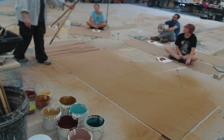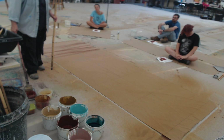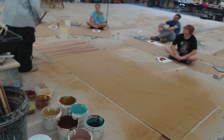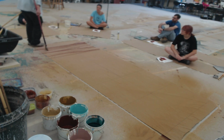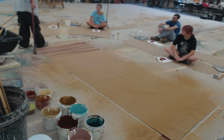Look at this brush. Look at this poor, tortured soul. Right? So we can do combing techniques using just regular brushes. But honestly, it's the scrappier brushes like these that do the better combing technique, okay? But sometimes we want a more coarse combing technique. And then that's when we take chip brushes, only chip brushes, and we torture them into these shapes. But if you want finer combing, you can just use kind of a rasty brush like this, and you can get finer combing just by letting it be its rasty old self.